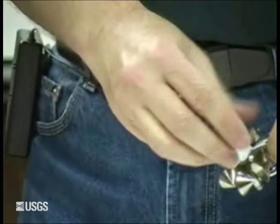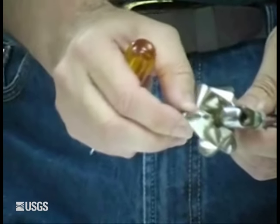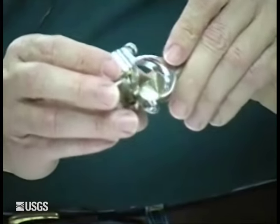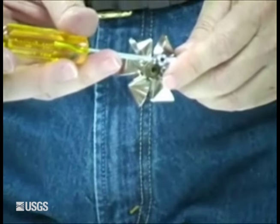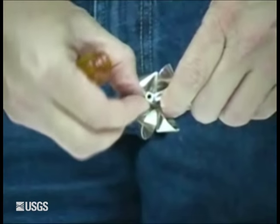So you've checked and it's not wobbling — this is a good one. Go ahead and remove the cap off the top, remove the pivot, then remove the entire bucket wheel assembly, which includes the bucket wheel, hub, and shaft. Some of these meters come out only one way. Sometimes you have to remove the pivot set screw completely before you can take the bucket wheel assembly off.